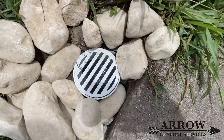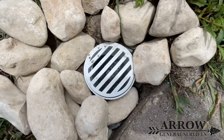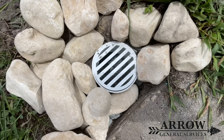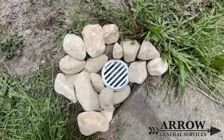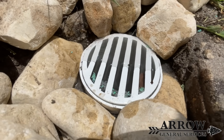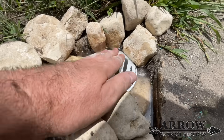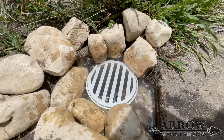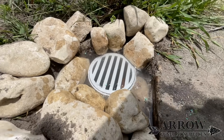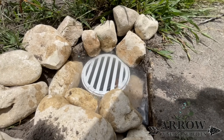We're going to the front now — you're going to see the water slowly fill up that two-foot pipe in the ground with the drain rock. As the ground can't absorb any more, it's going to slowly start coming out of the top, going around it, and once that area gets saturated enough and the ground can't take any more water, it's going to start slowly flowing over the sidewalk and into the road.